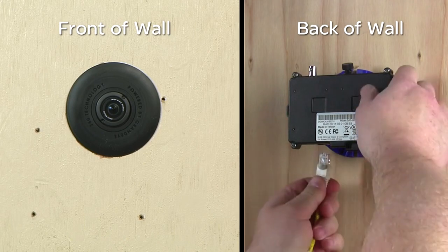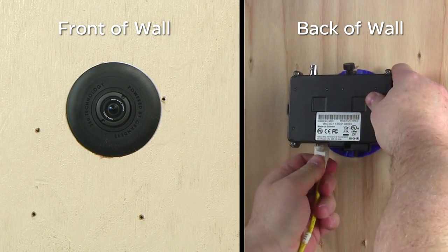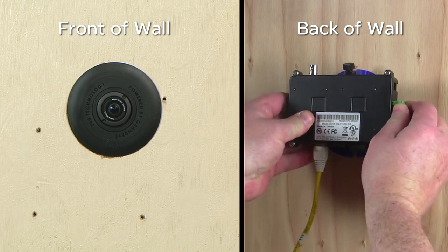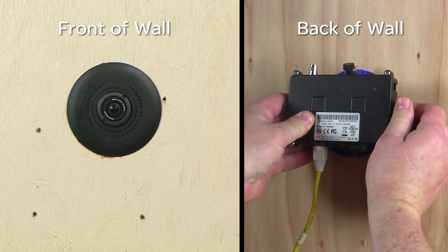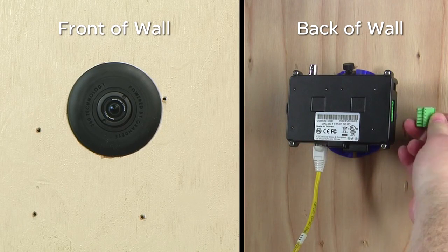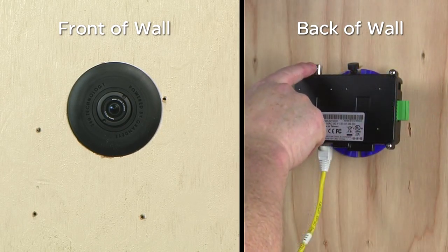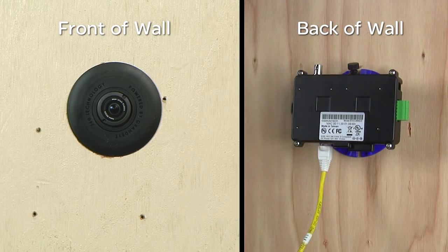You can route the wires under and then around or over the camera module to the connection points. The alarm connector can be removed from the camera module to facilitate easier connection and service. A BNC video connector is provided for camera testing and providing an analog spot monitor output.